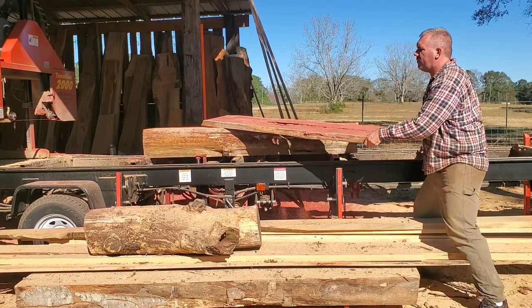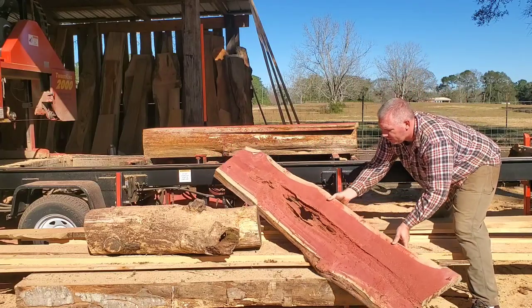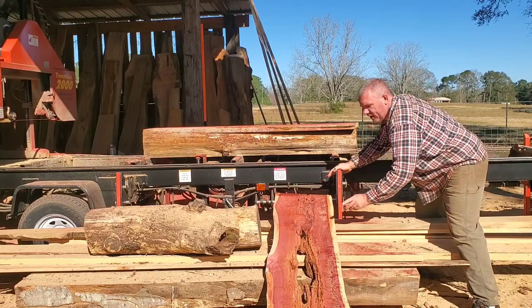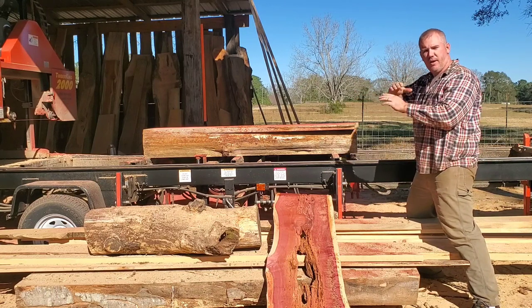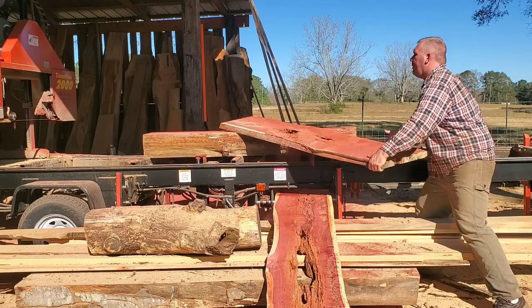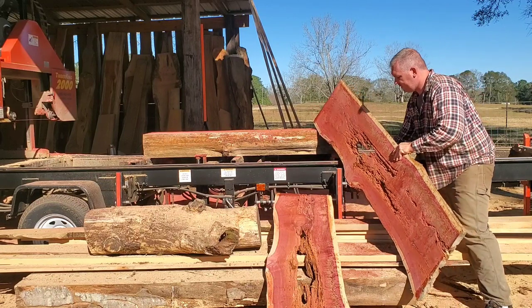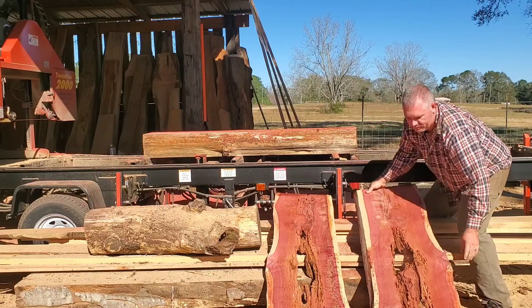And a fully hydraulic mill that is direct hydraulics. There are no solenoid control valves or anything like that for the actual operation of the mill, with the exception of the computer system, where there is a valve that opens and closes with solenoids. But for the most part, you are direct drive when you're using the handles. It's kind of a nasty slab, but you're direct drive when you use those handles and everything connected to the sawmill. So very, very smooth operation.